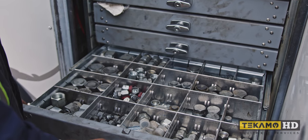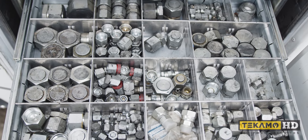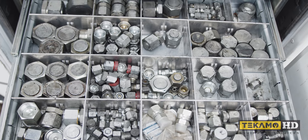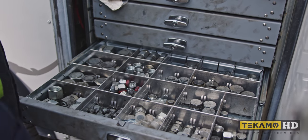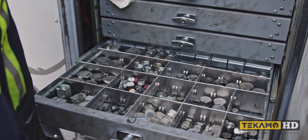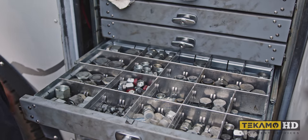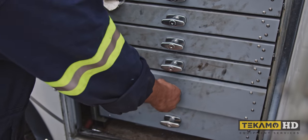You've got caps and plugs — you always need lots of caps and plugs because you go through them. They end up getting stuck on a cylinder, you send it out and you don't get them back because they give you plastic ones in place, so this is all considered consumable to the job. You want to keep things clean too — I don't like having scungy plugs because I don't like putting that on my customer's machine. The machine's got to stay clean.